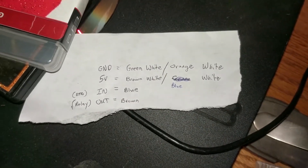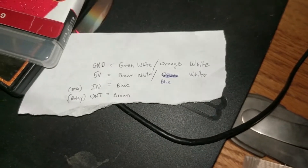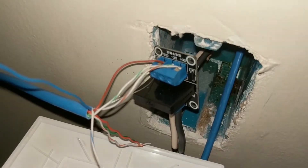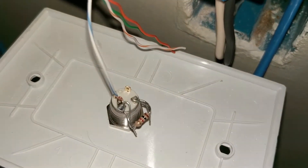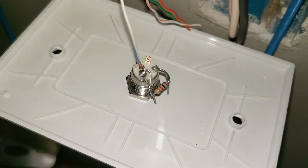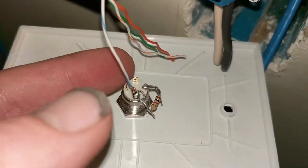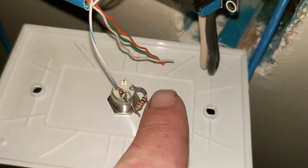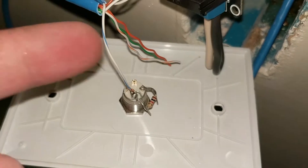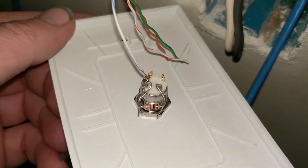When you push the button it will turn the light on. If you use the orange/white-orange/green/white-blue/blue-white/green/brown-white-brown format on your RJ45 jacks — that's your wiring reference. I've got my relay hooked up and the 5 volt power coming into the button. Since it needs a 5 volt signal to send back to the Arduino, I jumped off that same 5 volt line with a resistor to the positive on the LED, since that 5 volt will always have power.